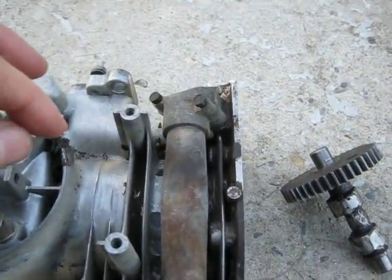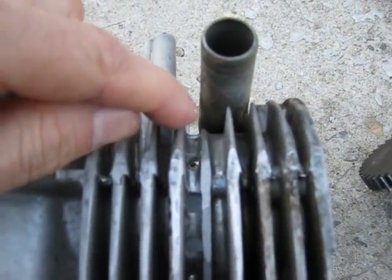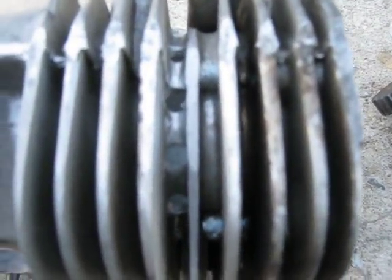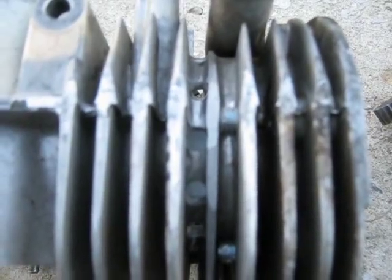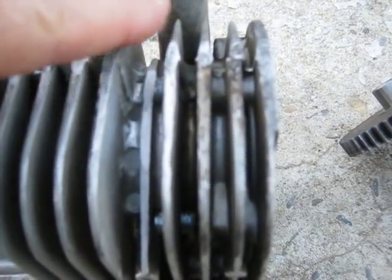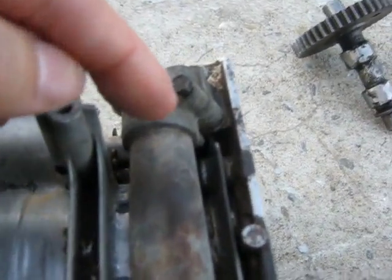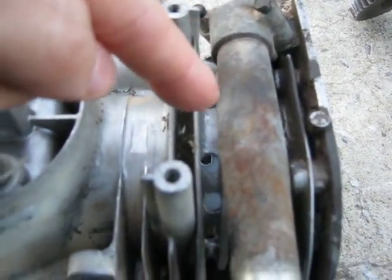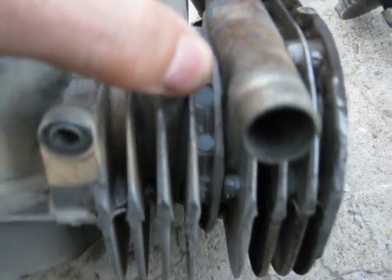What I've done is drilled a series of holes between this row of cooling fins. I just removed it here to create an intake manifold. This one has 3/8-inch holes, but I only used 1/8-inch holes on the mono-soupape. I covered it over with aluminum here to form an intake manifold, then put a sheet metal wall in here, connected with sheet metal and epoxy over to this row of intake fins. So it forms an intake manifold.